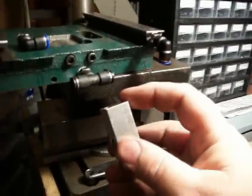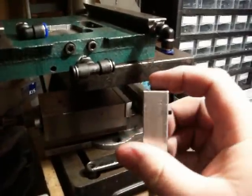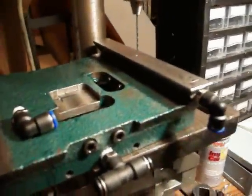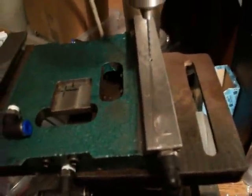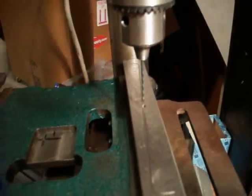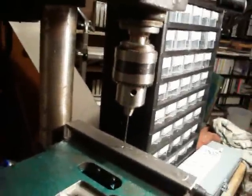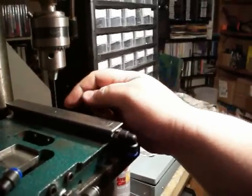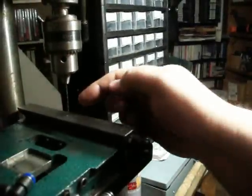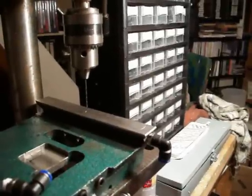It only needs to get oil down there - all it's really doing is providing a little path to drip oil down on top of the ball screw; it's not actually going into the ball nut. So my workaround for that is just use a hole that's already going down directly over top of the ball screw. This is the oil hole for the rear as you're looking from the front. I'm gonna drill a little sixteenth-inch diameter hole down through the existing eighth-inch hole I have there - I want it smaller. Otherwise you pump oil through here and it's gonna go the easiest way, which would be straight down. That's why I make it a lot smaller diameter - there'll be enough restriction to allow oil to still come up and out the side and out through the top to oil the dovetails, but it'll still allow enough oil to drip down directly onto the ball screw. That'll oil our y-axis ball screw.